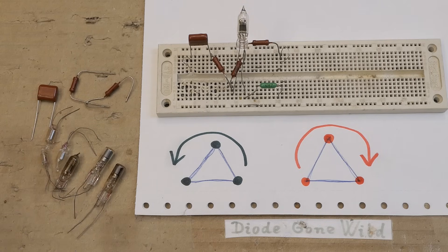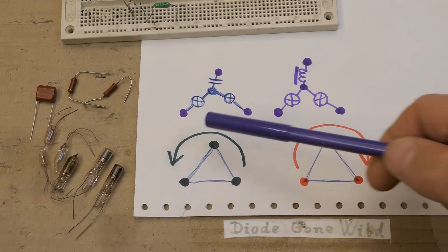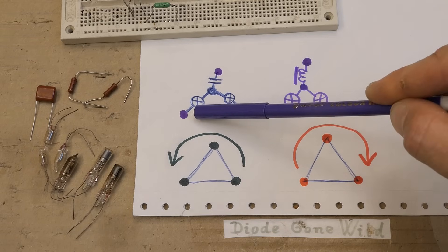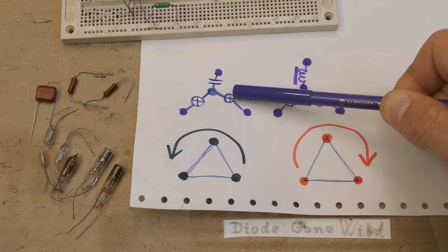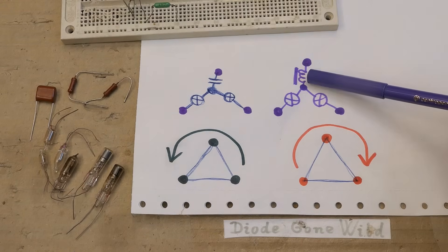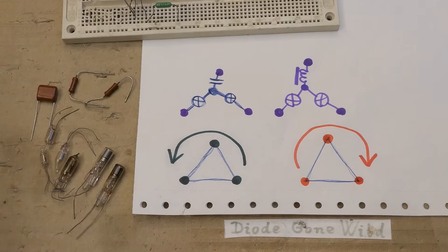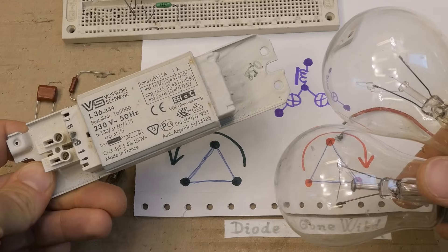There are several simple circuits to do this. The simplest ones use two tungsten lamps connected to two phases, with the center point connected to the third phase via either a capacitor or an inductor. Based on the direction, one lamp lights up brighter and one dimmer — the voltage doesn't completely cancel on one of them, so it's still dimly lit, while the other is much brighter. Sometimes you need pairs of series lamps because of the high voltage, making the indicator somewhat cumbersome.